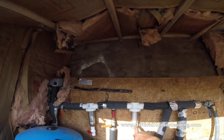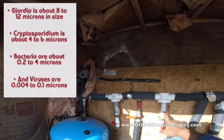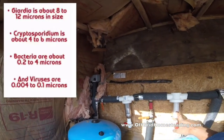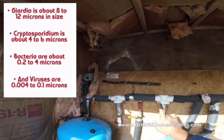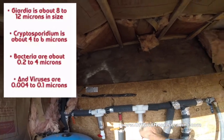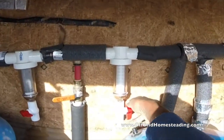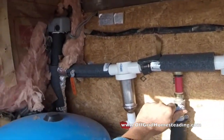Inside the trailer for drinking water, the 1000 mesh takes you down to 15 microns. For drinking, because giardia and some of those other things are between 10 and 20 microns, we have a special 0.9 micron filter inside that we use for drinking on the cold water side.